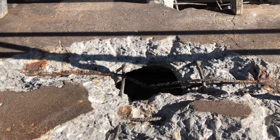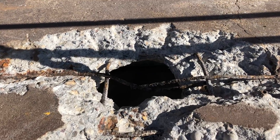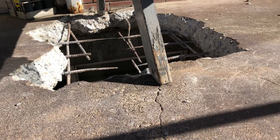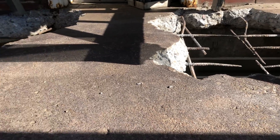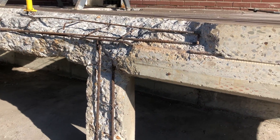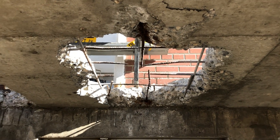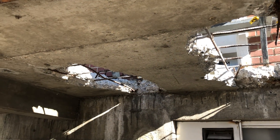As you can see, this is pretty badly damaged. A big part of why this was damaged is because cracking in the substrate let moisture get in down to the rebar. Carbonation in the concrete caused that rebar to start rusting, and that rusting causes expansion, which breaks away giant concrete pieces.